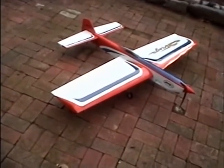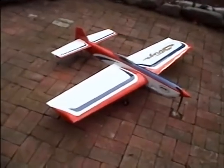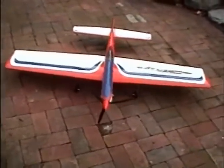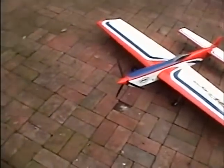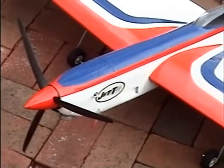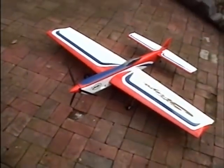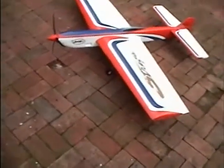They made some changes. Now, Mike's wing needed a big trim tab to straighten it out. Mine didn't. Mike's wing had incidence in it, and I'm going to check this to see if mine does or not. That could be a random thing, a piece of warped wood or something, and I'm not sure. One of the things I came away from, and this is why I needed to get a day of flying, I can't really shim my tank anymore in this, because my tank is a different shape than the tank that really should be in here. So what I'm going to do is make an additional set of thicker aluminum pads so that it runs richer, inverted. That'll hopefully make that a little bit better.